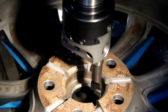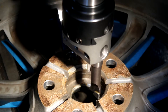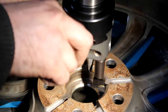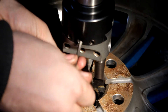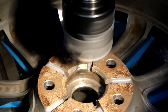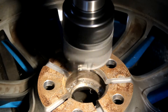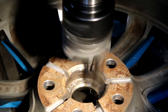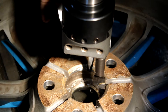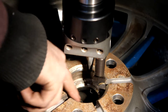What I'm going to do now is wind the cutter out until it's just going to take a really small cut. We'll take our first pass and see how on target we've gotten. Looks like it should just take a skim off it. Tighten up these three here which lock it in place, then we'll take a cut. You can see it's just skimmed it, and once it gets to the set depth it clicks and retracts. That looked like it took about 0.1 to 0.2 off. I can confirm my centre is set correctly because I can see it's just touched all the way around.